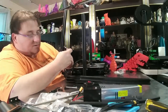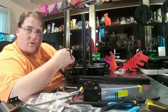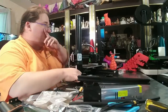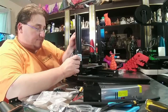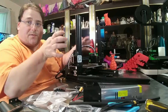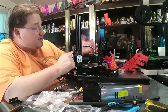When you install the top brace, two bolts holding it on — don't use the washers. These are hardened; you can put a lot of force on them, just don't strip them. Make sure it's fully inserted and crank these down tight. When you install the X-axis, make sure it's not too tight — it should move up and down very freely. Also very important: make sure the rails are straight. It's very easy to install them with a twist, and if they have a twist this plate won't line up with the arm. Just loosen the bolts on the bottom and give them the necessary twist to line them up.